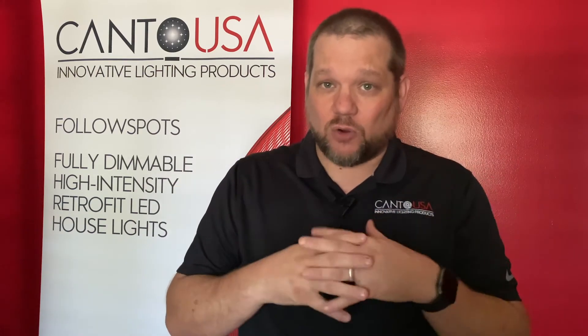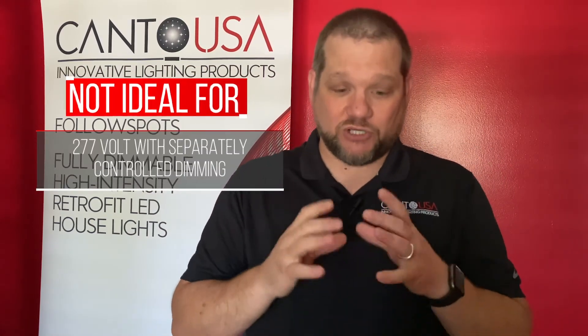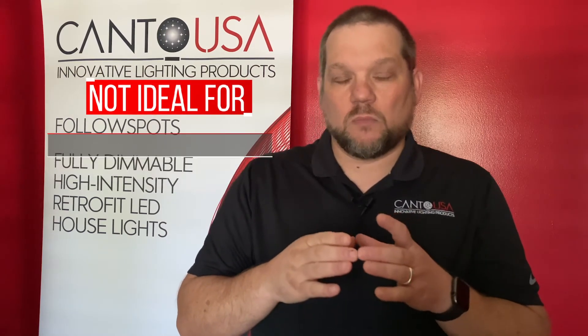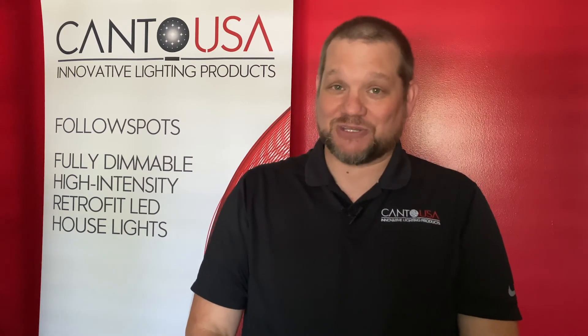If you have any questions about where we can go or can't go, call us. We're happy to talk to you on the phone about it so you get the quickest response. Where we shouldn't go: a big cutoff is 277 volts. We do have the Retro 700 and Retro 500, and we do have a driver that works with 277. But the issue with 277 — especially in America — is that 277 typically is not dimmed by the voltage itself; typically there's some sort of control signal that dims it. We can dim on a 277 volt where the voltage itself is dimming, but we cannot at this moment do anything with 0-to-10 volt, DMX, or anything like that going to the fixture. Another place we probably shouldn't go is outdoors — we don't have anything outdoor rated at this time. So 277 control signals and outdoor are the main limitations.